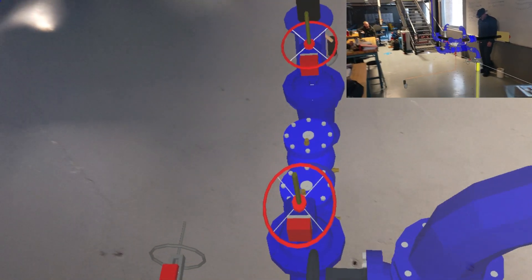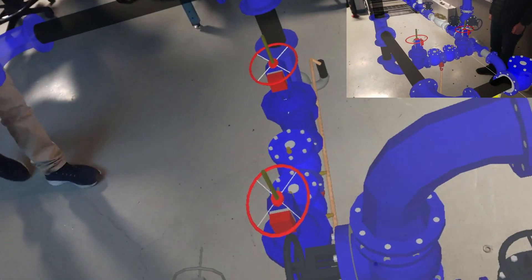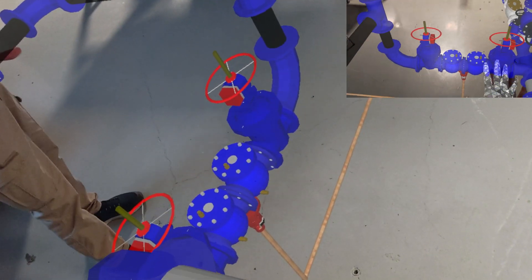It's right here. That's it, you got it. So that's the RP. Let's talk a little bit about how that RP works. The reduced pressure backflow prevention device is the first tee-off before the potable water. So if I go into this RP right here, is it a testable or non-testable device? Testable. It's a testable device.